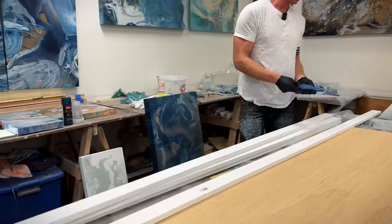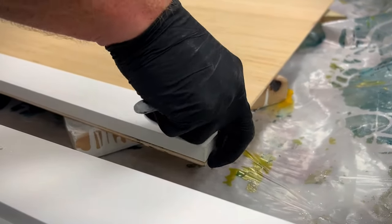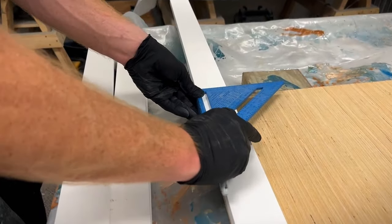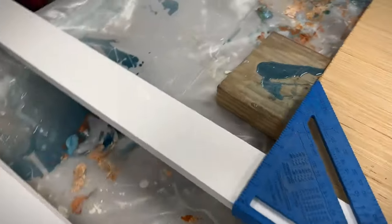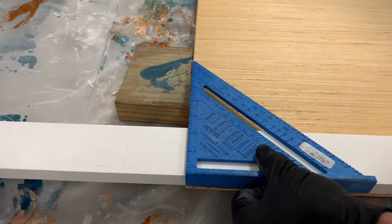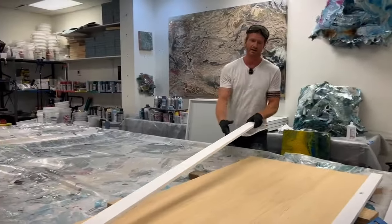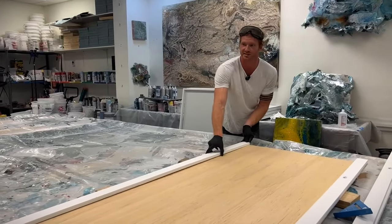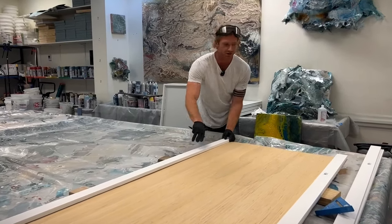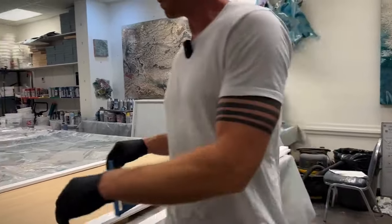I'll take one side and take a square. I've got this side all the way flush — it's perfectly flush. Then I go to this side, take my square, get right on top of it, and you can see that it's basically perfectly aligned. Then I make my line. I do the same thing on this side. Don't expect both sides to be the same length — it might just be a millimeter different, but that makes a difference. Always measure all sides.